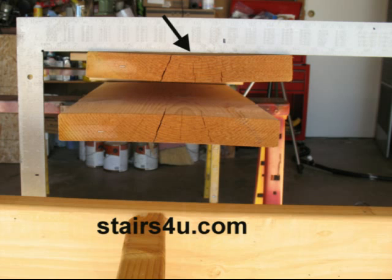Here's another lumber imperfection that stair builders deal with on a regular basis. Something like this isn't going to affect stair stringers that go up against a wall — that would be enclosed or in the center of a notched stairway. But it would be a problem if they were going to be on the outside of the stairway. For bracket stairs, if you're going to use angle brackets, this would be the outside or inside of your staircase stringers.